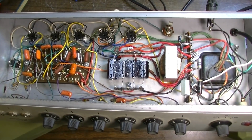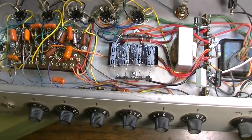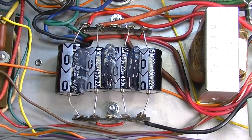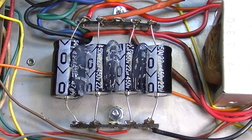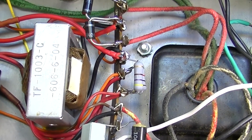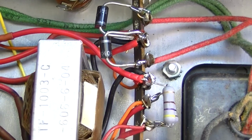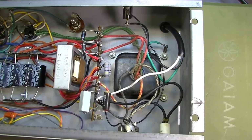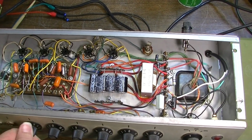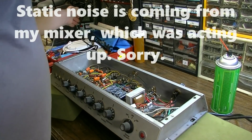Okay, we've gotten our new parts order in, and as you can see, we've got our capacitors for the power installed. Gone ahead and siliconed those together just so they don't move around on us. Also replaced, once again, those 2 resistors and the 2 diodes in the power section. Replaced the power cord as well, and we're probably most of the way there. We'll give it a quick test to see where we are on this thing. Alright, let's begin firing this thing up on the Variac now.